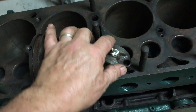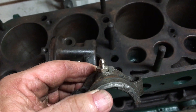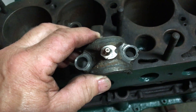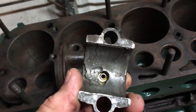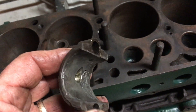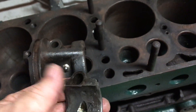I tried putting the grease zerks in the rod cap — that was pretty easy. Just cut the dipper down, drilled the hole out for eighth inch national pipe thread tap. As you can see, this was one of the rod bearings I was telling about where the babbit was real bad and not really usable anymore, but for this purpose it'll work just great.